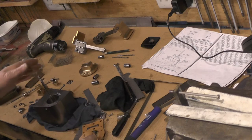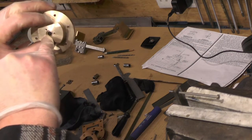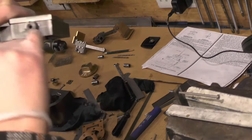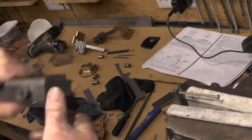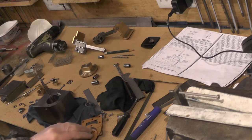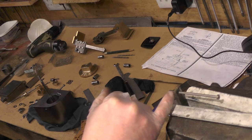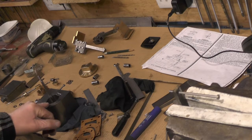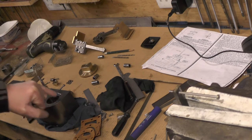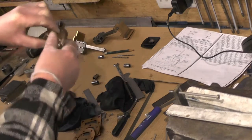I've also been sorting some o-rings out that fit where the piston rod comes through, and on the valve chest where the valve rod comes through. I've got the o-rings sorted out. At the moment I'm in the vice sawing some studding off, because I had some temporary screws in my covers on my cylinders and I'm now going to put studs in with nuts on.